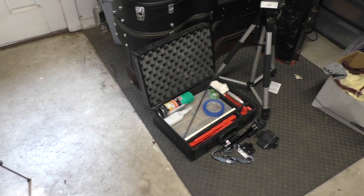The files for the V2 were found on Thingiverse. Someone with the handle MacG uploaded them a few years ago — it's a modular rocket that takes anywhere between 12 and 15 or 16 hours to print depending on resolution. I printed it on my Creality CR-10S and it came out pretty well; I had to tweak the settings a bit. The Z seam works out best if it's in one location rather than random — if it's random it makes lumps and bumps everywhere on the surface. There was lots of sanding that had to get done afterwards. I started with about 80 grit and worked my way up to 320, then primered it, painted it, and put some decals on it that I made.